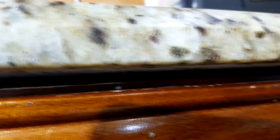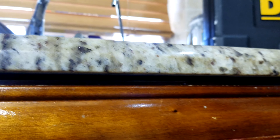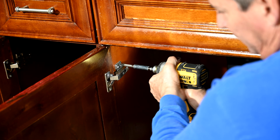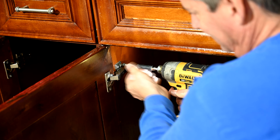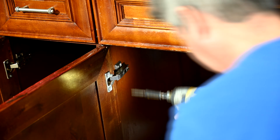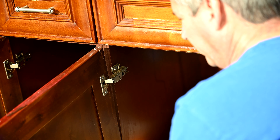I'm trying to shine a light in there so you can see — if you look way back in there, you'll see that kind of dark reddish brown. That's the caulk or silicone, whatever adhesive they used to cement down the granite countertop on top of this base cabinet. We have to slice through all of that, whether we use a utility knife, one of those drywall hole saws, an oscillating tool, or a sawzall. We have to be very gentle to make sure we do not crack this granite countertop. These are the four screws going through the cabinet wall into the next cabinet, so by taking off the doors we'll also be helping to separate the two cabinets.